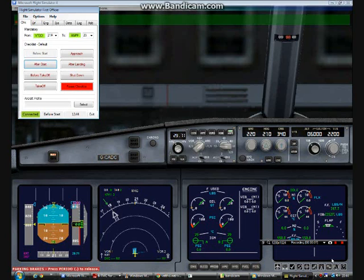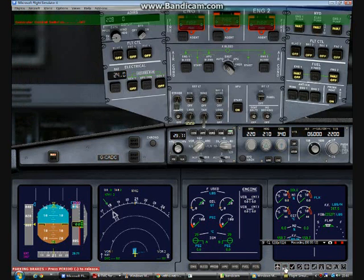Before start checks. Battery switches. On. Generator control switches. Off. Nav light. On. Parking brake. Set. Flaps. Up. Throttles. Idle. Fuel cutoff switches. Cut off. Ground proximity warning system. Checked. Equipment cooling panel. Set. Probe heat. On. Passenger signs. On. ATIS. Obtained. Altimeter. Set. Takeoff weight. Checked. Flight recorder. Set. Doors. Closed. Beacon light. On. Before start checklist complete.